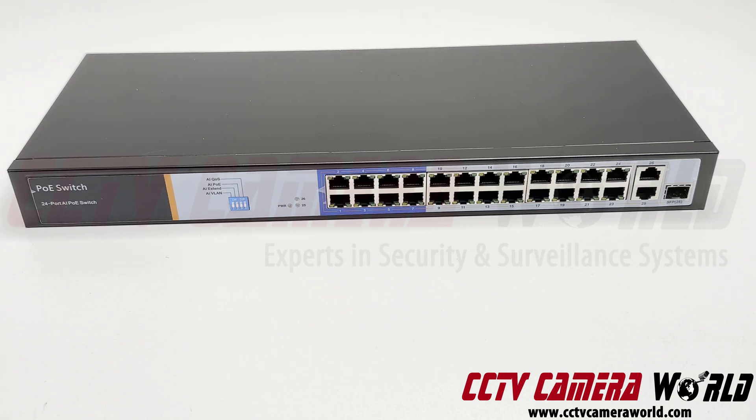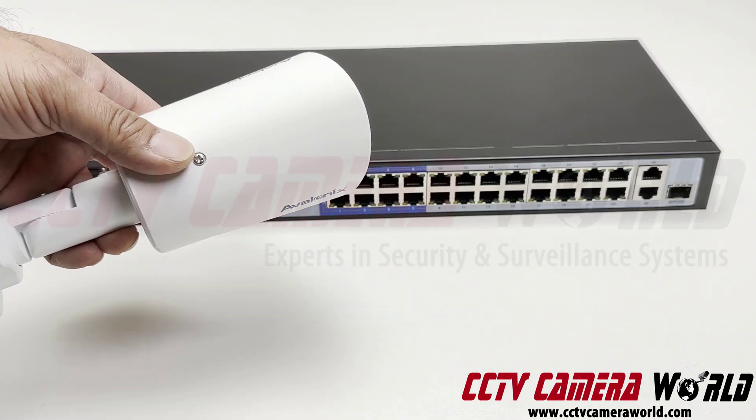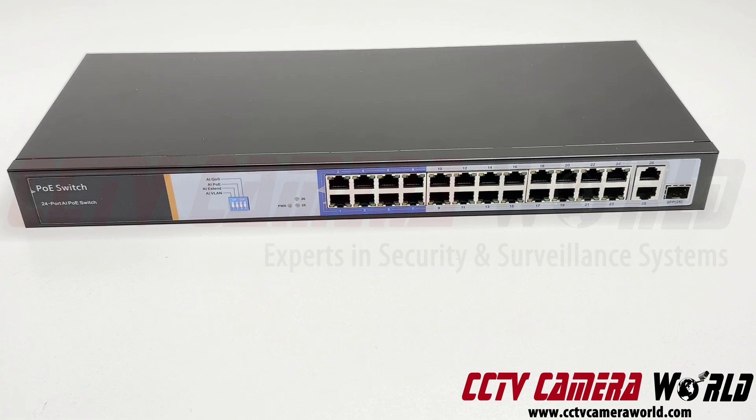It's great for use with fixed lens IP cameras. A camera such as this one can be used up to 250 meters away with this PoE switch without needing a PoE extender. All you do is make sure you use a very good CAT 6 solid copper cable, preferably UL listed, and run it straight from the camera to the PoE switch and it'll power those cameras without issue.